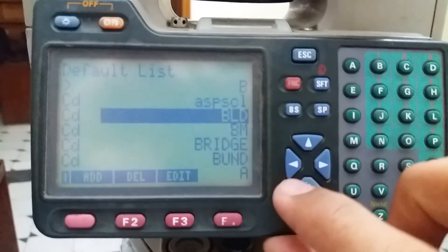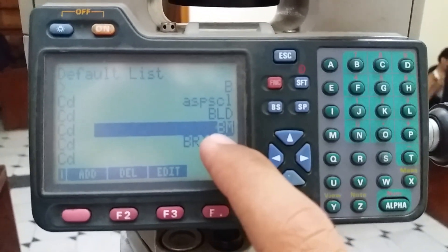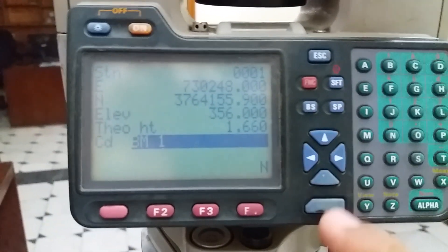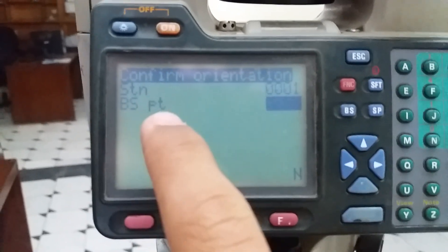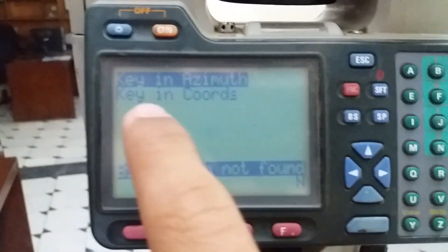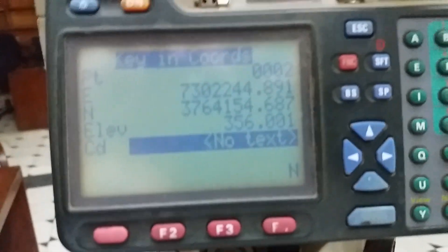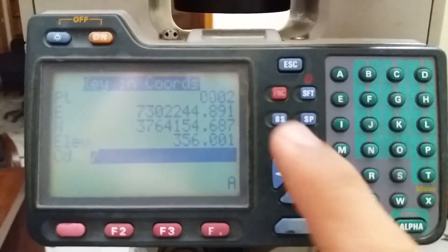I will give it benchmark. All the list is included; when I click the letter B in alphabet mode, options like building and bridge come up. I enter BM, change it to alpha, type BM1, and enter it. Input accepted — station is good. Now I enter the backsight back point and give it a numbering, then I pass the easting, northing, elevation, and code fields for the backsight coordinate.